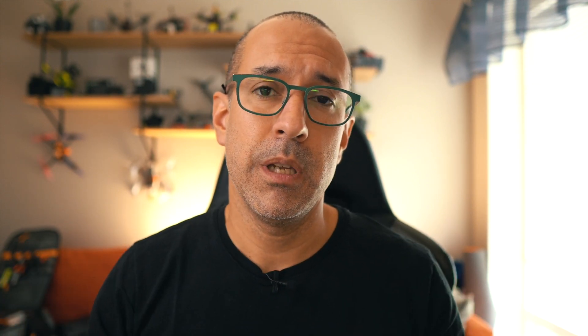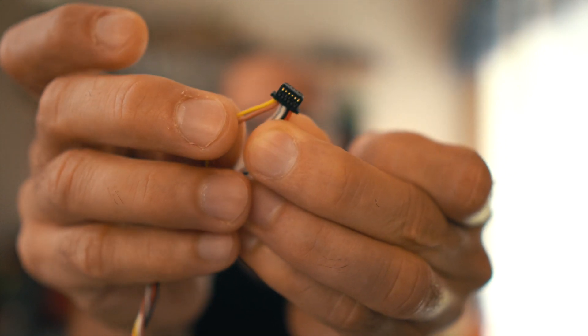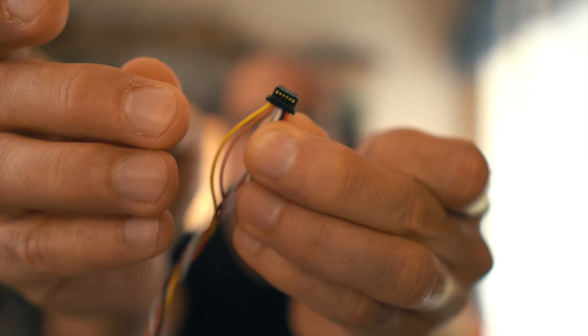The symptoms you'll see are that the receiver sometimes works and sometimes doesn't. In some cases with certain receivers I've seen it not work at all — the receiver binds to the radio, but when you go to Betaflight and try to see if it's responding, you see no movement whatsoever. The solution is super simple: you're not going to be using the DJI protocol to control the drone anymore, so from the DJI harness you just remove the SBUS cable and the ground attached to it.